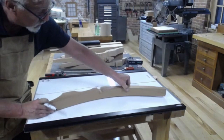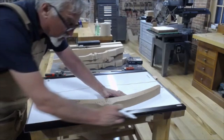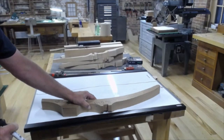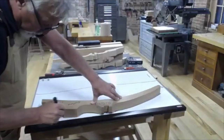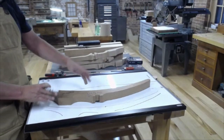What I prefer to do is put this seat joint right up against the jointed surface of my stock. And like I said earlier, it's best to have 8/4 stock. 1 7/8 is okay. When you start getting below that, you're compromising the structural integrity. So I can actually get 2 pieces out of this, right? I can get another one right here. And normally the grain is complementing and they look like each other as well. It's the same color.